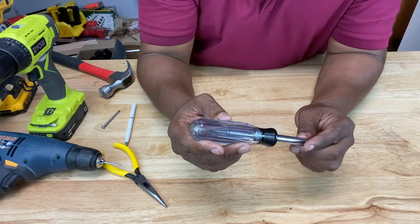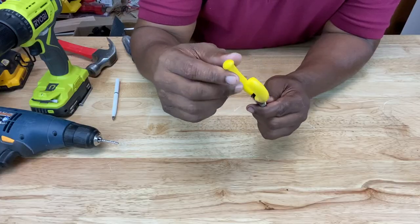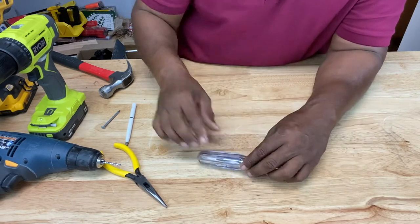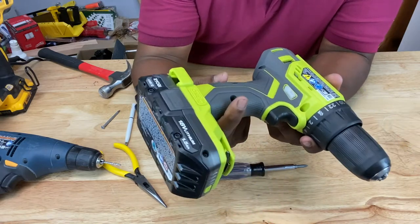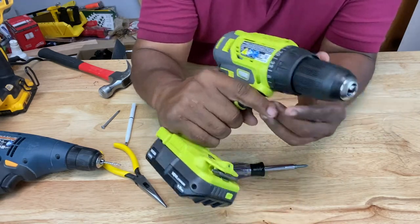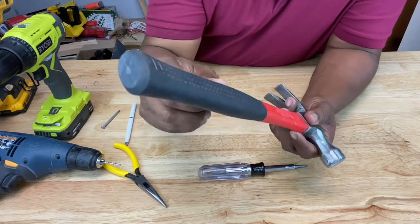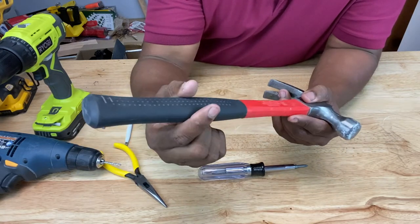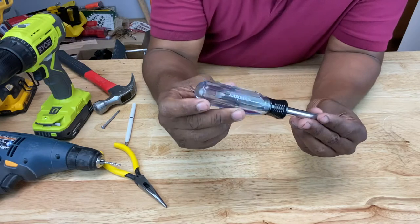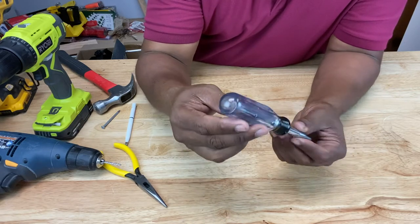Some more ergonomic requirements include the diameter of the handle. Handles should be cylindrical — around 1.5 inches in diameter, and about 0.45 inches for precision tools. This screwdriver has a cylindrical handle that makes it easier to hold. The drill's handle is more elliptical, but that actually makes it more comfortable. The hammer handle is also designed to be elliptical rather than a perfect circle — that's more comfortable for larger or longer tools. A screwdriver is shorter, so a perfectly round handle works well there. These are the nuances you discover when you study ergonomics.